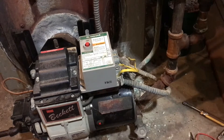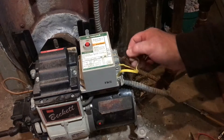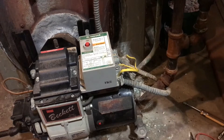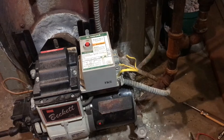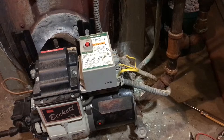What I did is I turned the thermostat up so the boiler would turn on, and then I disconnected one of the wires going to the CAD cell — the eye that actually sees the fire — and waited for its time period. It locked out at approximately 45 seconds, which is normal for this particular control. It has a 45-second lockout time. So I've already confirmed that it locks out, so that's good.